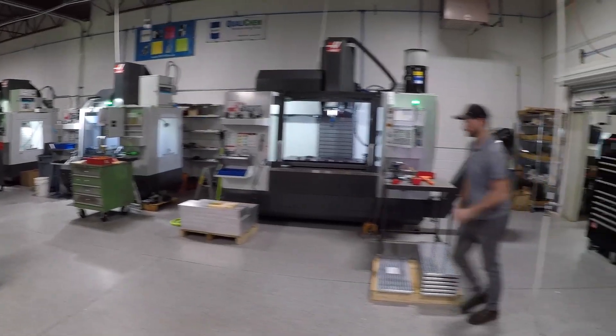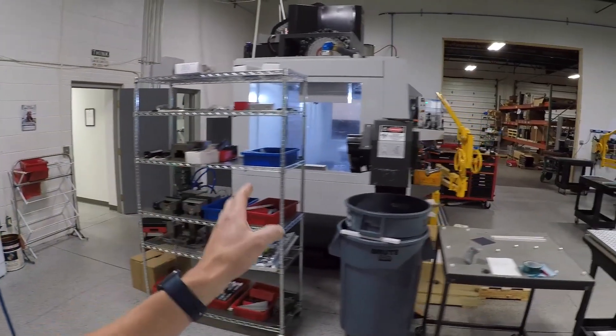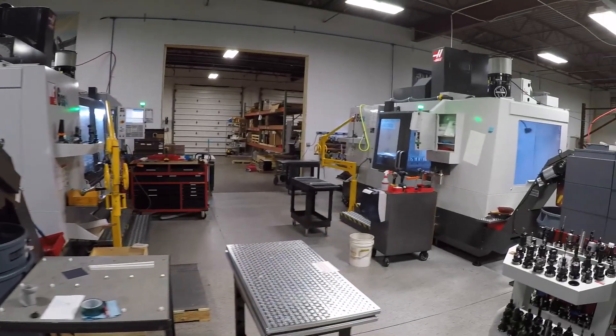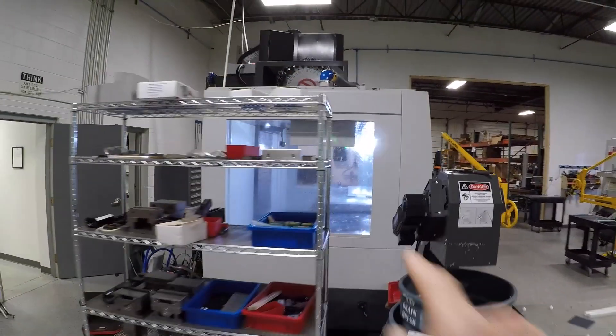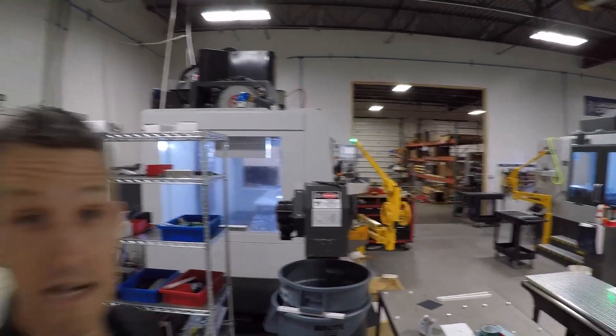I'm standing in an empty space and this is really exciting. We bought an Okuma Genos M660. The M560 is a super popular machine — it's kind of their 40 by 20 — but we wanted the step up, the size up. So the M660 has approximately 24 by 56 or 58 inch travel. What we really wanted was effectively a bridge mill. We love our VF6s and the Genos is going to be a similar work footprint, but rather than a C-frame machine we wanted a double column bridge mill design. It's a totally different kinematic design, totally different in terms of thermal capability, and it's really going to help us up our game on our fixture plates. So we'll do a whole video on that.